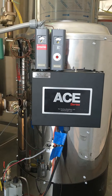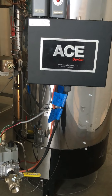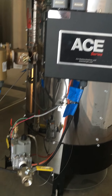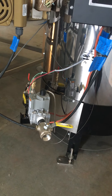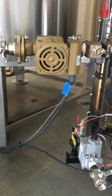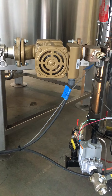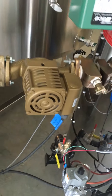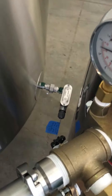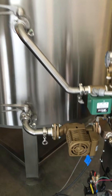The other group of wires goes through this tube along the back of the tun and comes out the other side. This needs to be wired to your boiler. There are two power wires — one is labeled and goes to the control box where the gas hooks up, and the other goes to the hot liquor pump, which is the recirculation pump. It's wired specifically for that, so don't swap the wires around.